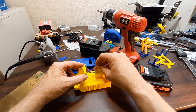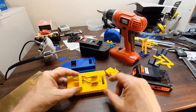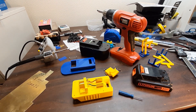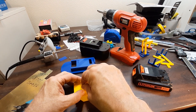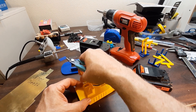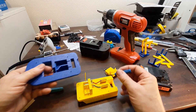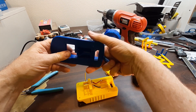These were already soldered of course. When you finally get them how you're happy with it, wherever you've got the room for that barrier to sit in there — now you're going to want to take a couple of pieces of PLA. These holes right here are for alignment. You put the PLA through there and get it lined up. These are just for alignment — they're going to come out as soon as we get it assembled. These contacts are just captured in place; they'll float around in there a little.